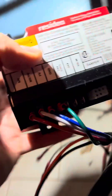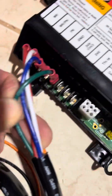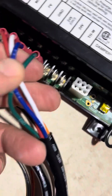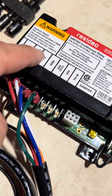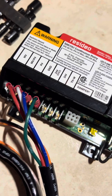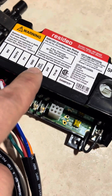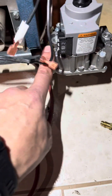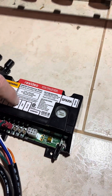Now we're going to install the electronic ignition board on the side right over here. These are really good because they're actually labeled: GND goes to ground, PV is pilot valve, MV is main valve, and MV/PV is the common shared by both. Then you have the 24-volt ground, which runs from the board to the gas valve.